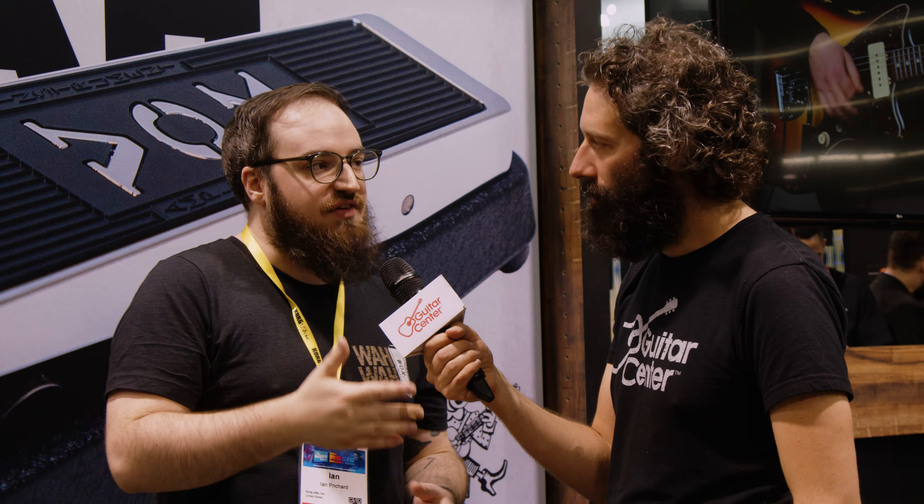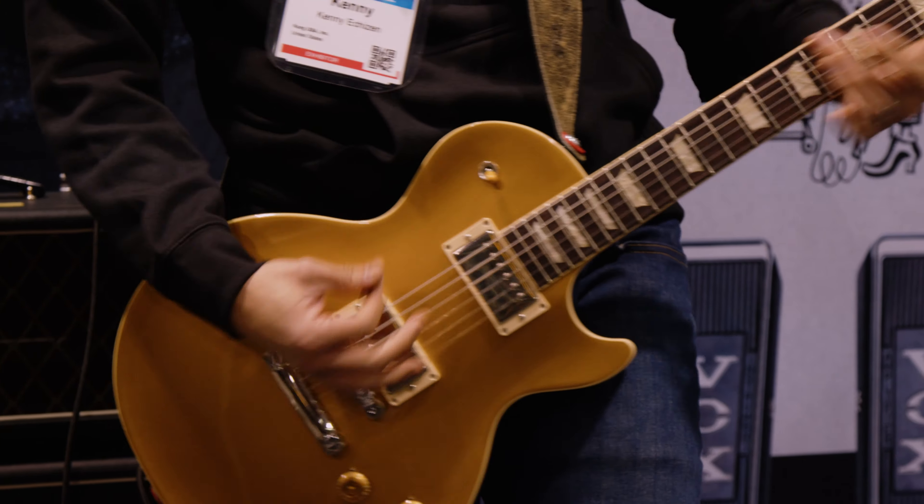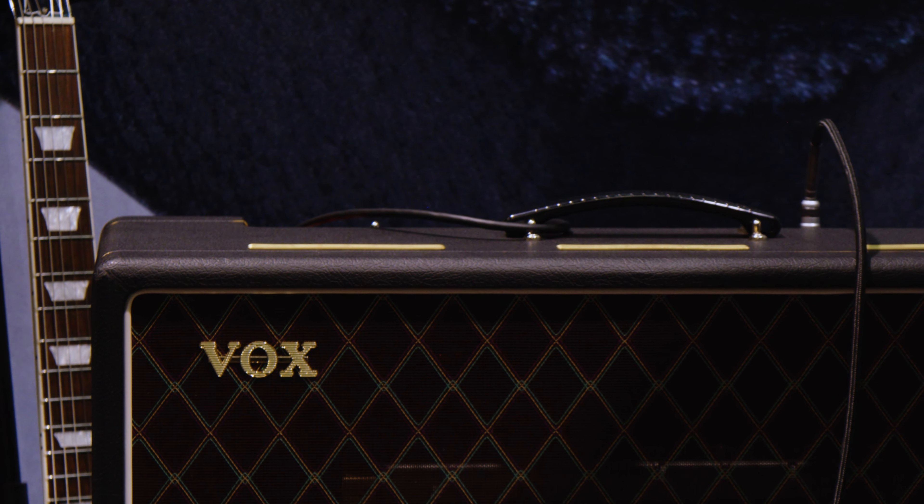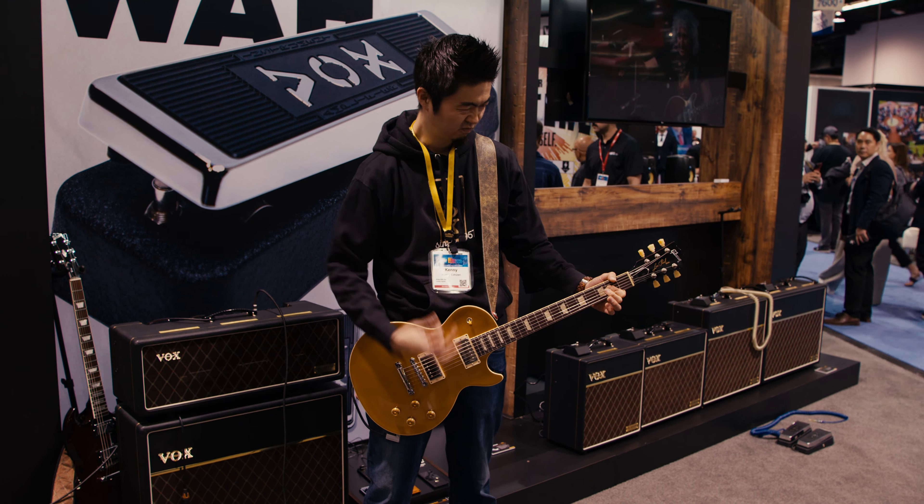What we did — and it was a similar process when we did our WAS — a lot of the part variance is very different now, so every unit is going to be slightly different. That's why we had to find the right unit, what we've been calling the golden unit, that we could base things off of. We voiced to that unit as opposed to recreating a schematic. We were more interested in recreating the sound, and if we have different part values that give us that sound, we use them. Luckily we now have really accurate parts with really low tolerance, so we can have that produced at scale and they all sound the same. We designed to that specific voice — some of it's the aging, some of it's the difference in parts — but we solidified it so that it won't change unit to unit.